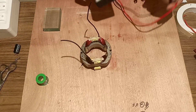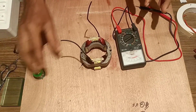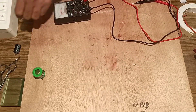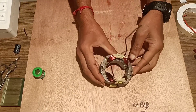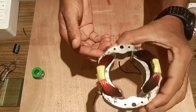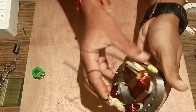Next, using a multimeter we will check the continuity of both the coils. Once we get continuity on both ends of the coil, we will join the two endings and make a series connection so that we get the maximum length of coil winding. This type of field winding has two coils on both sides.